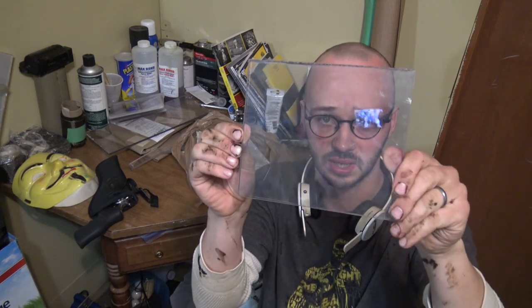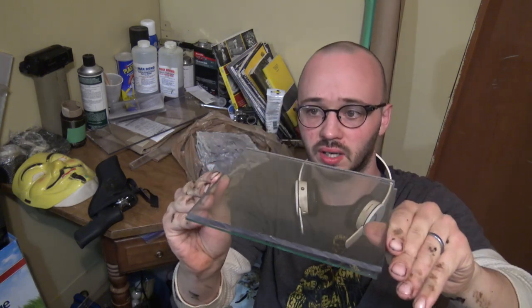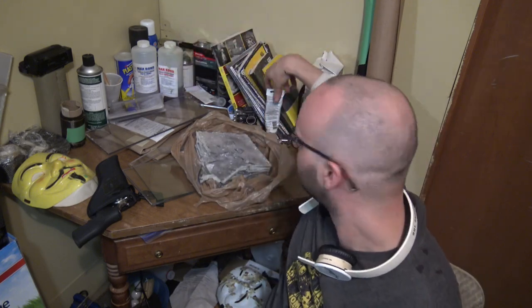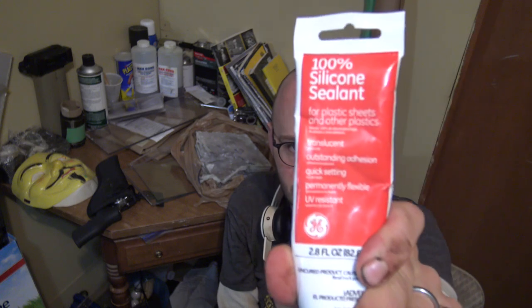Pretty much it's straightforward from here. I cut the polycarbonate to the same size as the glass, heated it up in my oven, and laminated it — one piece of polycarbonate with glass, polycarbonate glass, all the way up four layers thick. That was able to stop eight rounds from my Magnum. I'll show you the cutting steps briefly to talk about the best saw blades for these plastics, then get into the lamination step. The silicone sealant I used was 100% silicone sealant, the cheapest kind — you can pick it up at any hardware store.